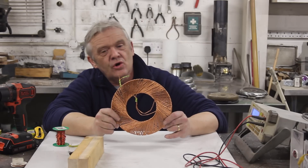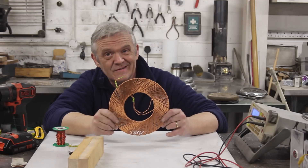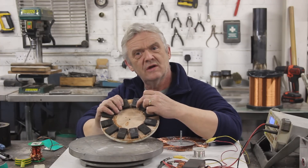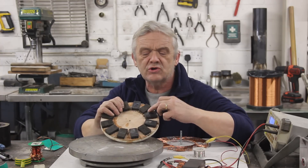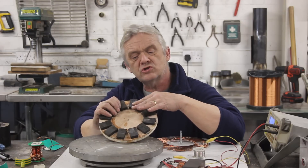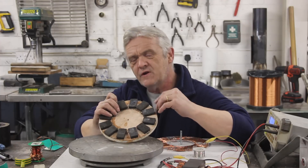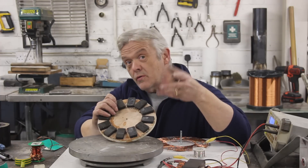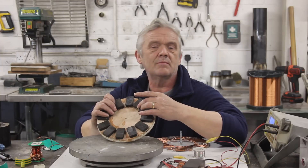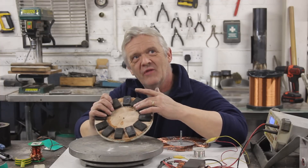You might have noticed that when I hold up the coil there are in fact four wires coming out, and that's actually important. When you begin your wrapping, you start there and wrap until you get there, then jump to here and continue going around in that direction. That creates one space covering north to south with no south to north. If you finished your coil there — at that arrangement — you can do that easily because we drew the magnets on the piece of plexiglass so you can see where the magnet starts and finishes. Everything would be perfectly fine.